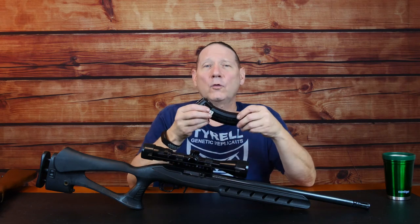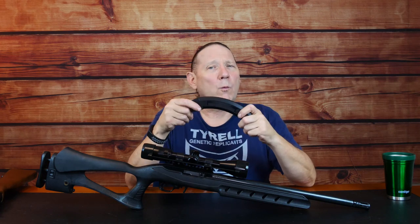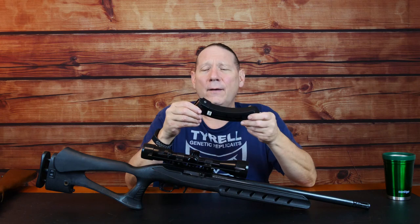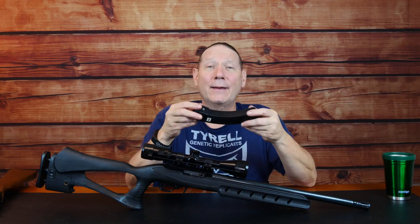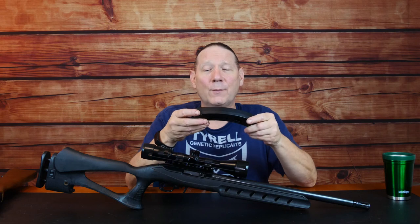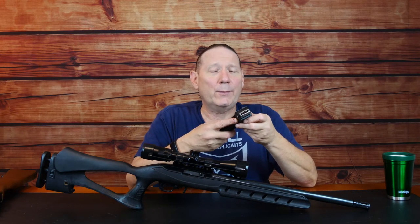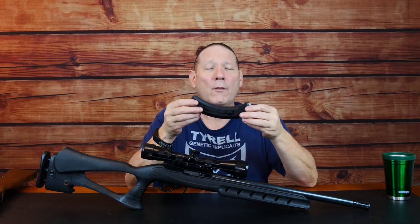I tried cleaning and lubricating the inside of the magazine with different lubricants. What I will tell you is that didn't do any good, and I used some DuPont spray Teflon lubricant, which actually caused a lot of failure to feed issues. It didn't work like I intended. I had to take all my mags back apart, re-clean them, dress them up, and then put some CLP on the bearing surfaces. I did not try what some people do, where they make a modified .22 shell and put it inside the mag. I didn't even bother with that.